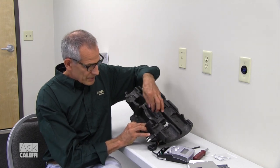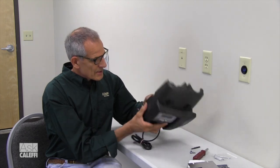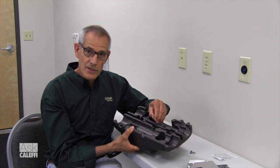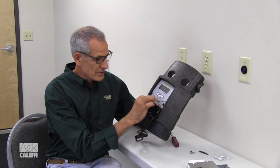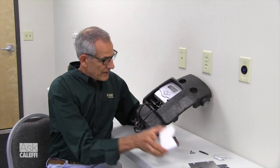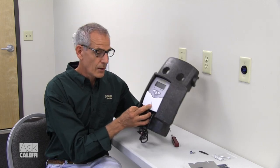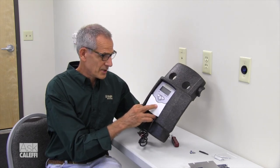Push the screws down with your Phillips screwdriver, put your controller in there, then reach down and tighten them up. Make up your wiring connections and put the trim cover over it, and you're set to go. So there's option one, two, and three: screw it to the wall, put it on the special mounting box, or put it right in the foam jacket for the front of the pump station.